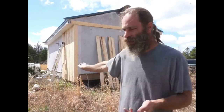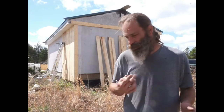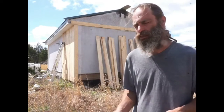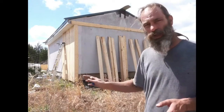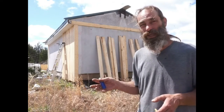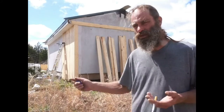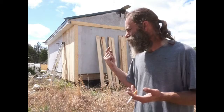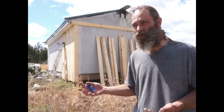So the real secret is finding a way to let it get out. At least in a small countryside cabin like this, when I'm in the woods and there's no inspectors or people to tell me how to do it wrong, because the cost of installing all the things in order to actually keep the stuff perfectly dry is a little bit prohibitive for me, especially at the moment. So instead, I'm making sure that everything has a way to dry out. So when I do whatever I'm going to do to seal up these planks, I'm not looking at creating a perfect moisture barrier there either. I want the wood to be able to breathe a little bit. And maybe I have to come around with a hammer and knock a nail in a little tighter, or put a new screw in here or there from time to time. But it's going to be easier to throw it up. The wood's going to have a chance to air out and dry out on sunny days like this, and we get more sunny days than rainy days.